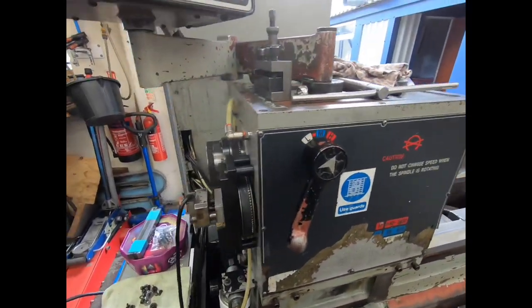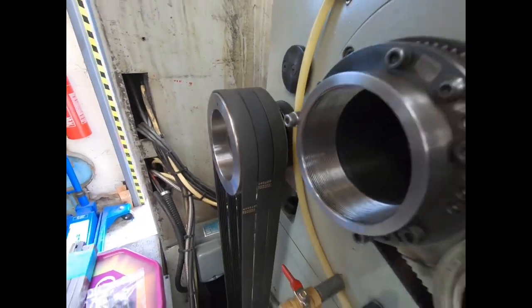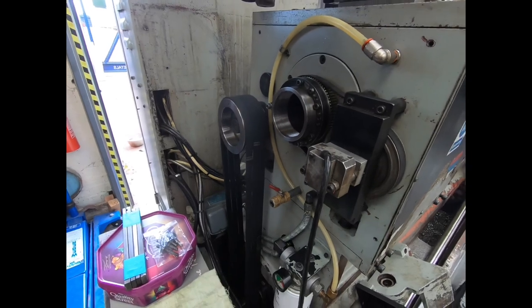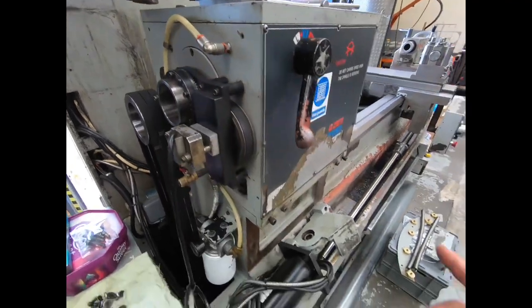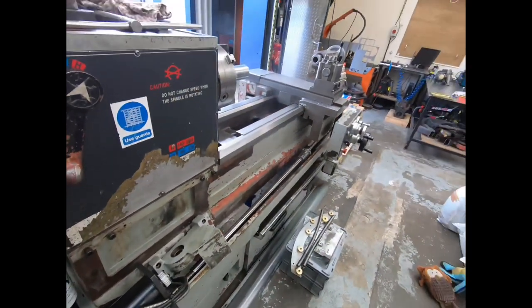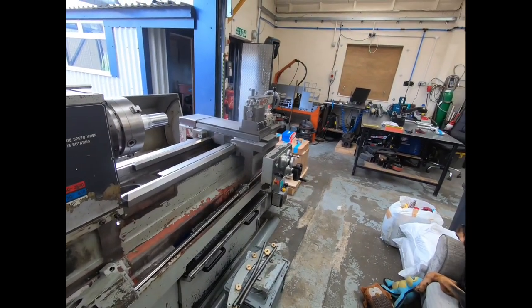I've sorted the oil pump. There was a three-belt pulley system — it had one belt on it, one belt missing, and one belt in about six pieces but still attached. Now we've got a new encoder belt, new motor pulley belts, new bearings for the X and the Z — on the angular contact end and the support end.